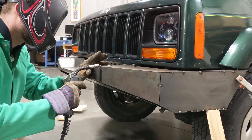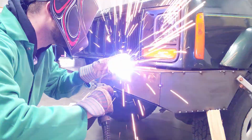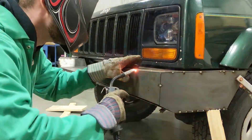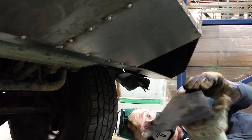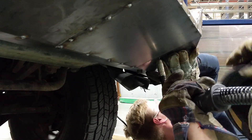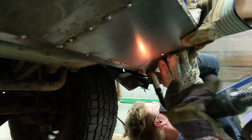The only thing you had to be careful with was getting the angle on these front panels correct, because if you didn't, the farther down the bumper you got and the more panels you put on, the bigger your gaps got. We got things pretty well lined up though, and I think the biggest gap we had was around a sixteenth of an inch, which is pretty good for a 3D object made out of flat sheets.